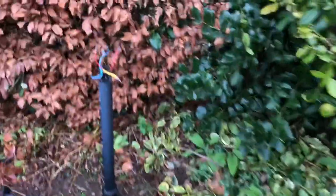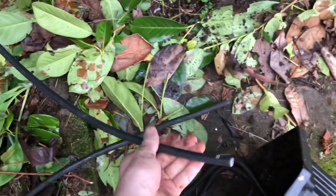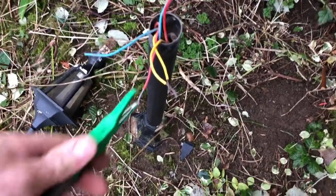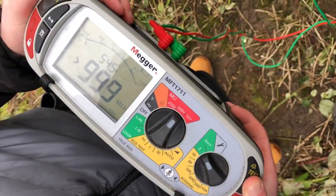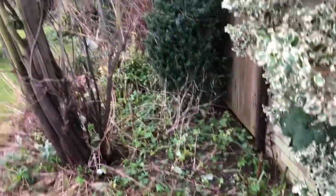I've done the same to this one — we've got this light taken down. If you look in here that's where all the connections are, but I'm going to redo all of them so I've just cut the cable there. What we've been doing is chasing the fault — I'm joining both earths together because again I can't see which one's which. I'll go and test it and that's showing a very poor reading, then on the other one it's showing a good reading. So this one here with the poor reading follows on to the lights throughout the rest of the garden.